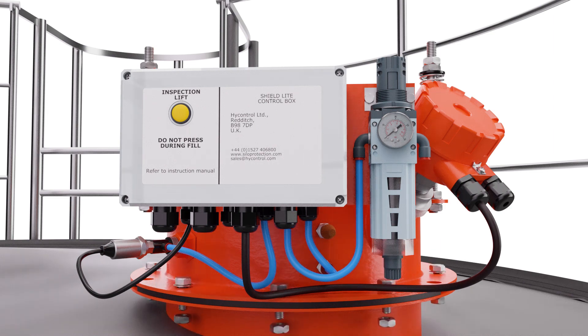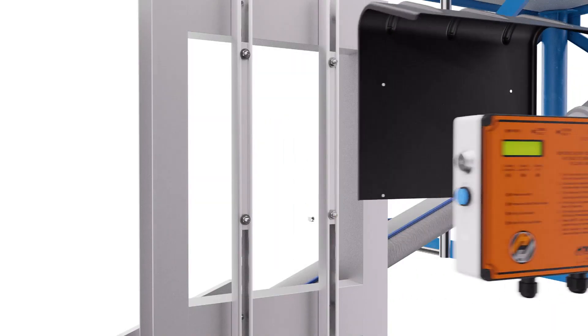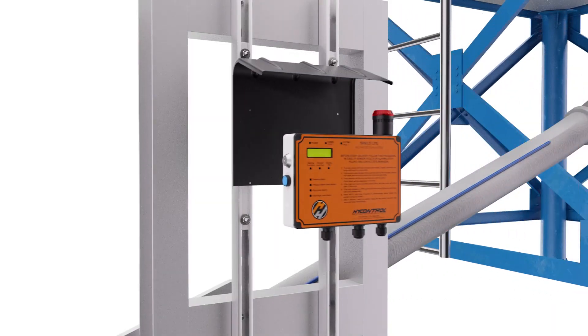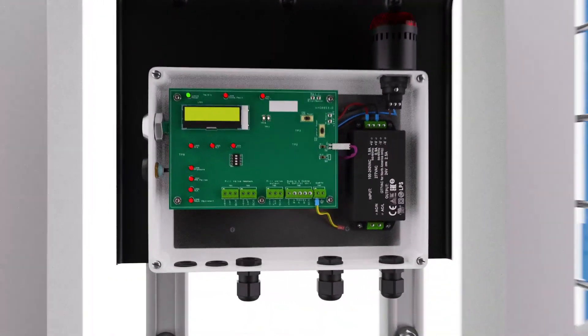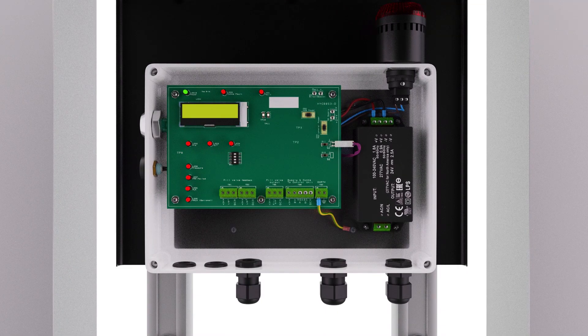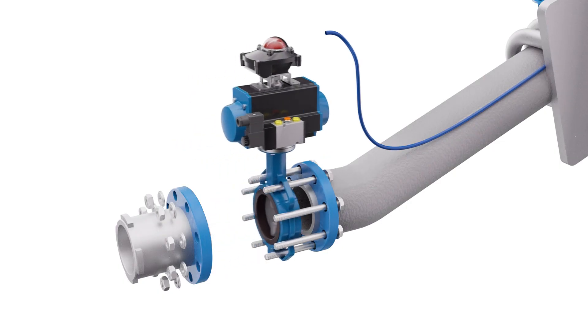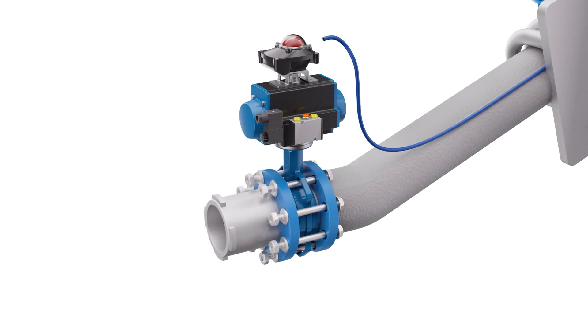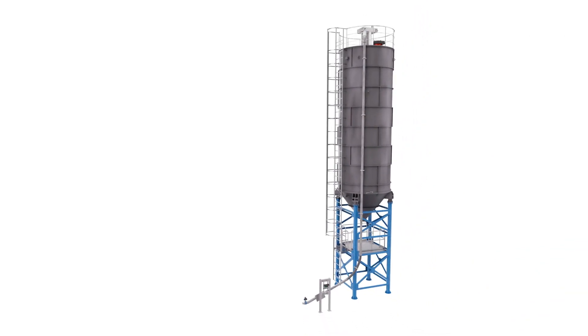We provide all the necessary bolts with the system. Before wiring the PRV, mount the display panel and its weather shield near the fill point. These use the same locating holes, so the panel can be attached through the weather shield when the cover is off. The mounting screws are not supplied. Install the normally closed butterfly valve at the fill point and connect the airline. This completes the mechanical assembly and we can now move on to wiring the system.